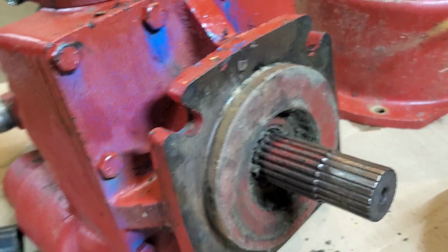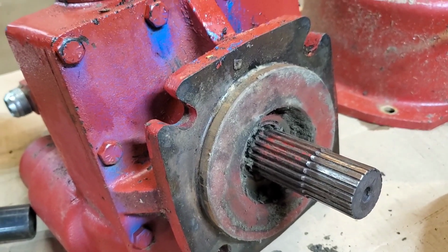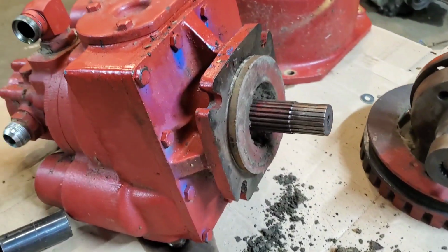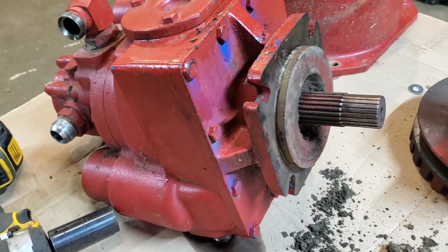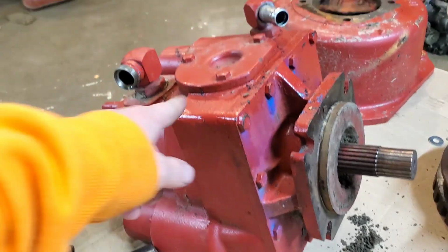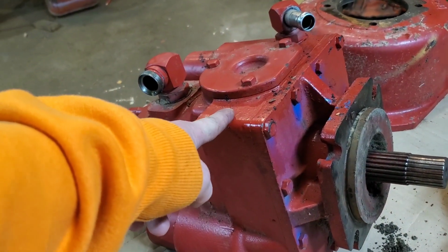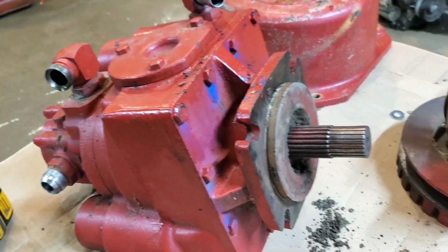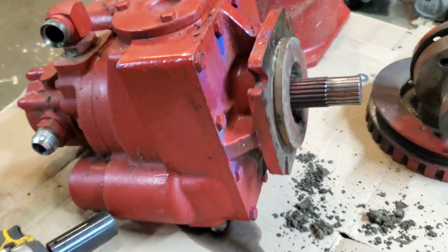It is $1,300. But no hydraulic shop or hydrostatic shop or anyone who is able to rebuild this pump or replace that shaft is going to want to just replace that shaft. They're going to want to rebuild the whole pump, which isn't bad. It worked until the moment that the spline sheared off. It was working just fine.